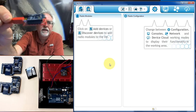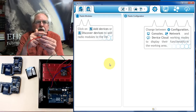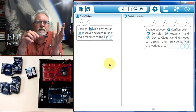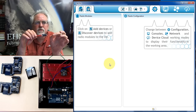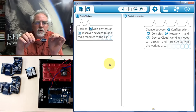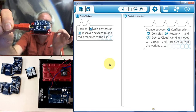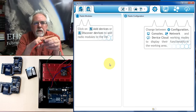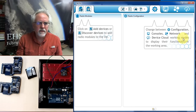That little antenna needs to stay horizontal, because students a lot of times want to come in and stand it up straight. You can move that antenna up and down about 4 times before it falls off. And once it falls off, you can try to solder it back on, but it's very hard to get back on. If you're doing it, just leave it like that. Don't let anything bump into the antenna. Don't jiggle the antenna. Be very careful with the antenna and don't be bending it around to different locations. I've ruined several radios by getting that little antenna messed up.